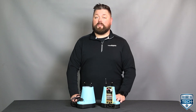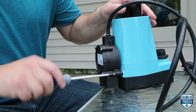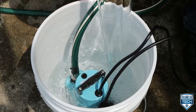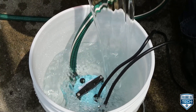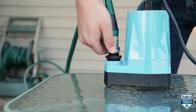Automatic or manual options give this product application flexibility. For automatic options, the Little Giant-designed diaphragm switch truly allows you to set and forget. Operating using atmospheric pressure underneath the water, the sleek design of the diaphragm switch has no moving parts, eliminating any worry of anything getting hung up. Using the 3/4-inch garden hose adapter, the 5 Series easily pairs with a garden hose to move water up and away from the source.